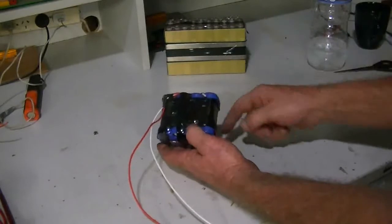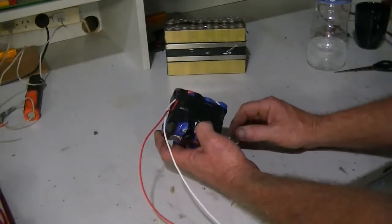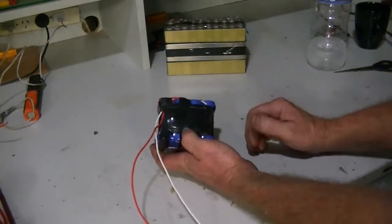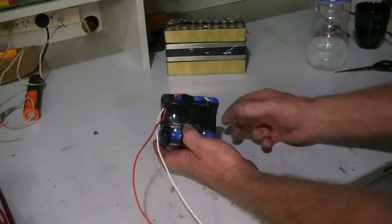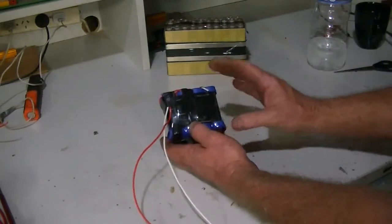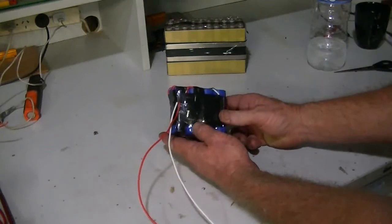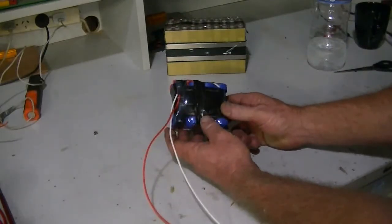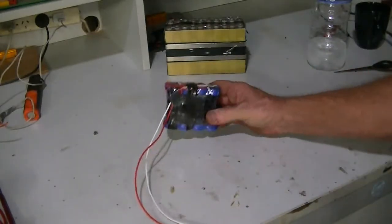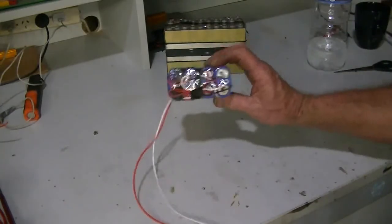I could have left the black insulation tape off, we would have been able to see our BMS and everything, like you were looking through glass, which probably would have been good because we can then see if there's any faults, if the battery cacks itself, if there's any faults with the BMS visually, as in a burnt resistor or rectifier or a MOSFET. But the BMS is under there. But there you go. That is my El Cheapo recycled heat shrink wrap, and it does an absolute beautiful job.